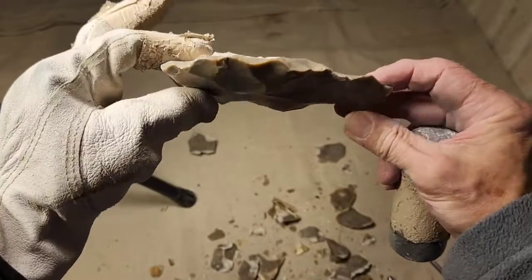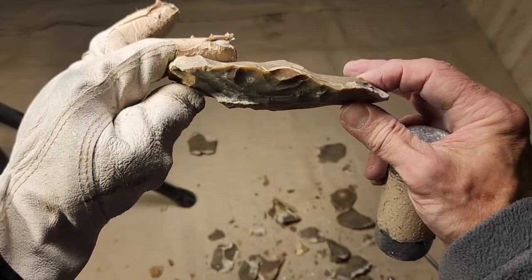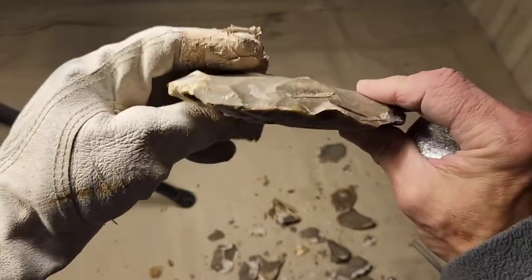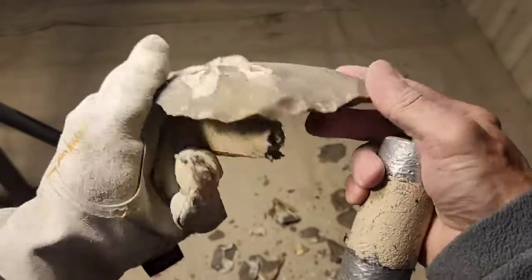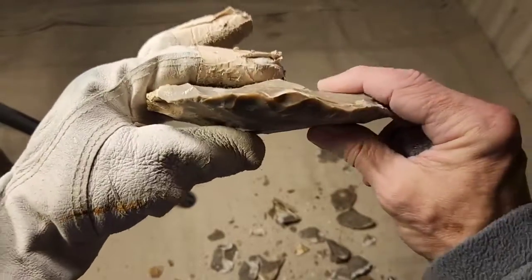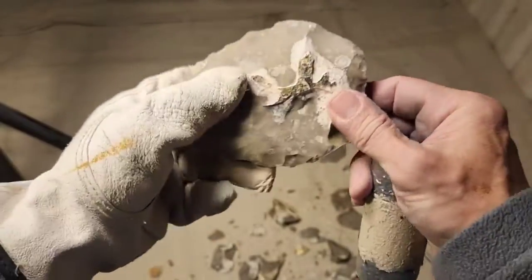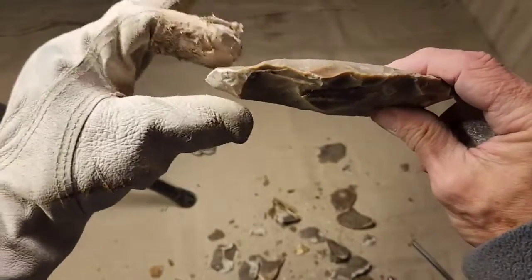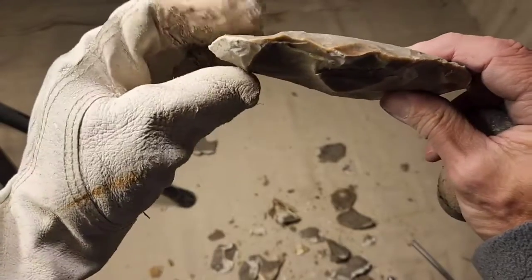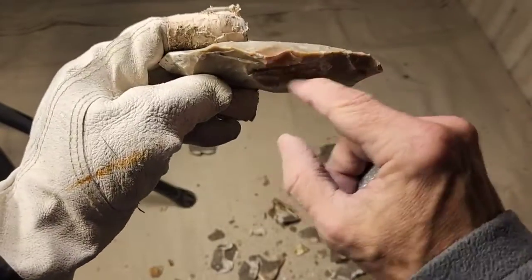All right. I am now looking at the ends to see if they are still remaining thin compared to the center. The center is now getting thinner, so I need to proportionately thin the ends again. Namely the tip here in this case, I'd like it to be thinner, and I'm going to do some more thinning here before I tackle the middle.